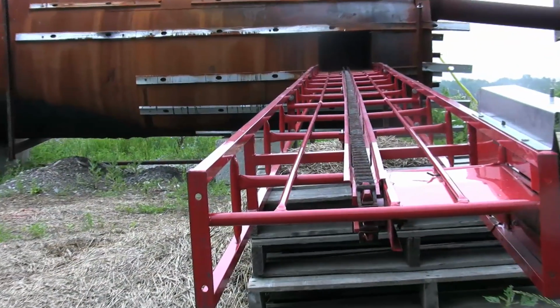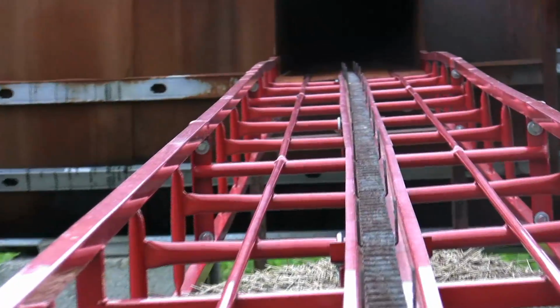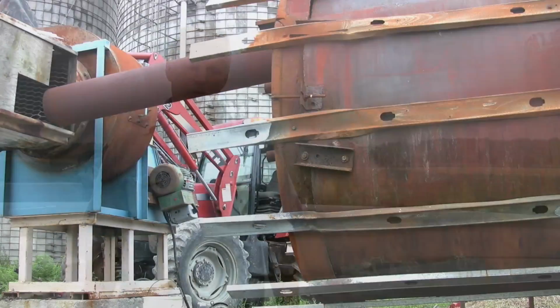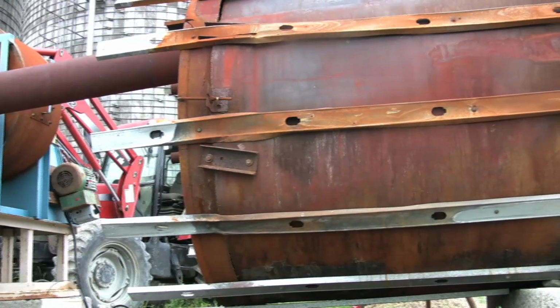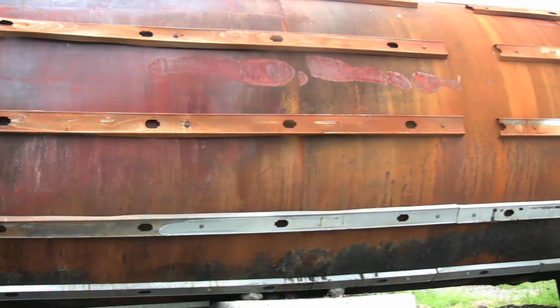start drying corn. Take them out, put them on just a plain skeleton elevator that we use for moving hay, with a DC motor on it and a controller on it, so that we can speed it up or slow it down. And if we need more heat, we speed it up. If we need less heat, we slow it down. And the bales are fed into a big burn chamber where you start the fire up and it starts burning, and it makes an awful lot of heat.